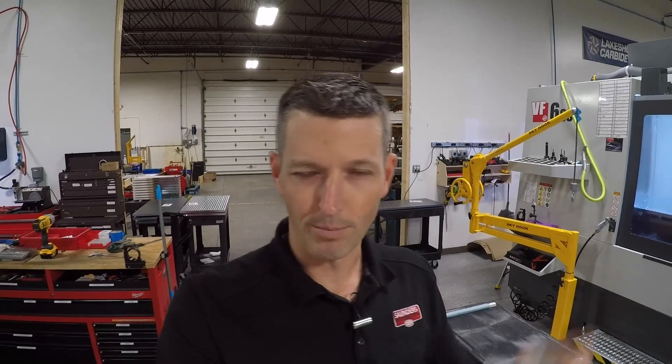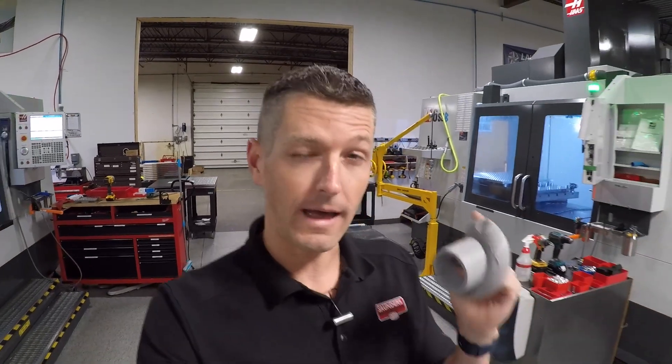Once we come up with a variety of these shapes and sizes, we'll put them over on the NYC CNC website. I really wanted to have most of these able to be made with either super basic sheet metal tools or to be 3D printed on an FDM printer, because that way anybody can do it for relatively low cost. We also took some of the 3D printed ones and spray painted them with effectively Rhino lining — like the truck bed liner — which really seems to help their chemical resistance and abrasion resistance.